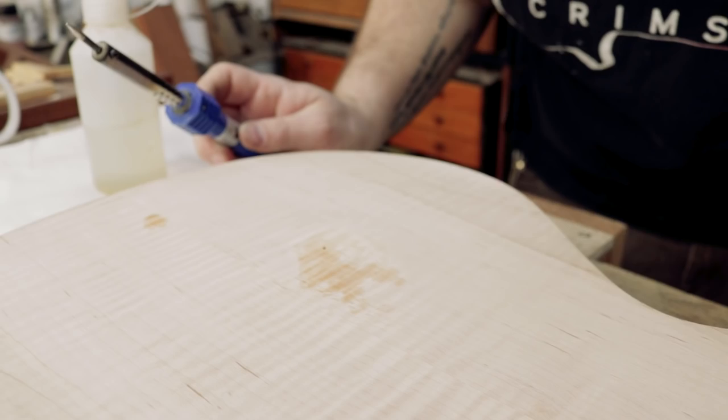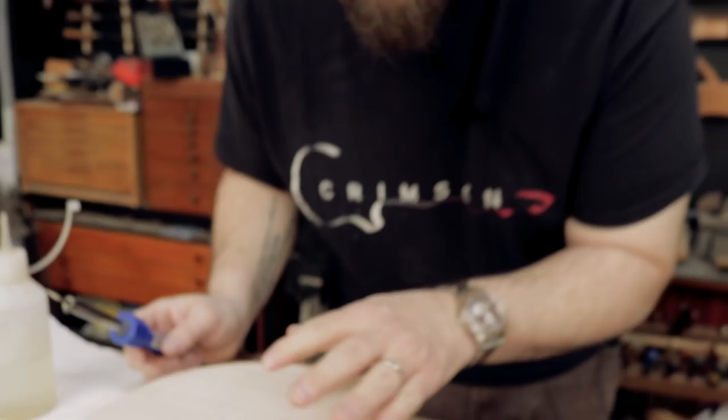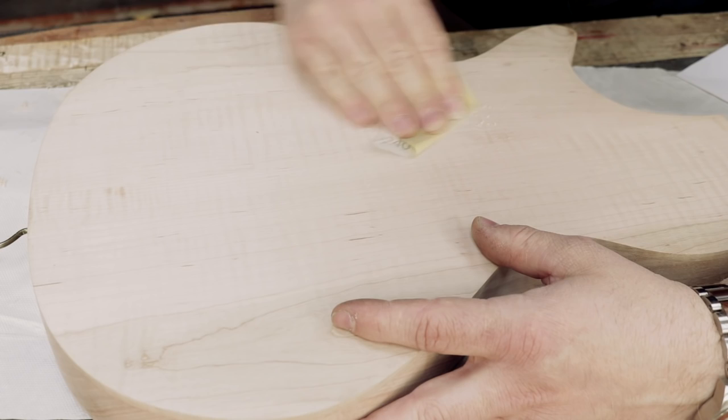Okay, I'm struggling to see what's going on here. Running low on steam — I'm going to leave that to dry for a couple of minutes and we'll see. There's nothing there — there we go. Both dents have gone, so it was a dent and not a scratch. This works particularly well on raw wood, and it is used to repair mistakes that happen during the build predominantly. If you have lacquer, you have to take the lacquer off and then fix the dent, or fill in some other way.